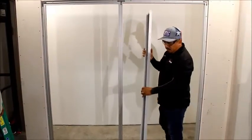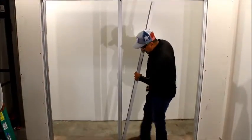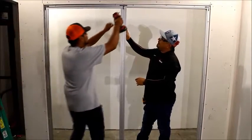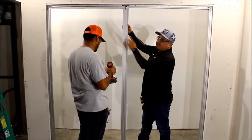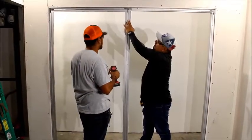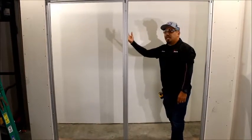Now we're back to install our RN-199. We've got both sides knocked out. Get your anchor for your strike side, set it in there, and make sure that it fits right and sits high. Remember you have a set screw — go ahead and remove that set screw; you do have them on both sides but you're just going to run one side. Take that out, push it in together, and set it right here so it doesn't move down. Now put the set screw back in. Pull it 8 to 12 inches and keep the same spacing on the other side.